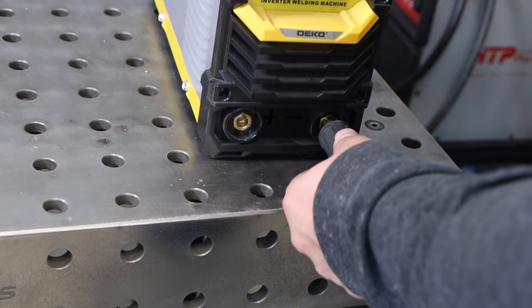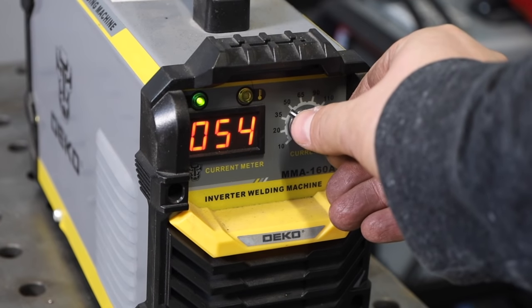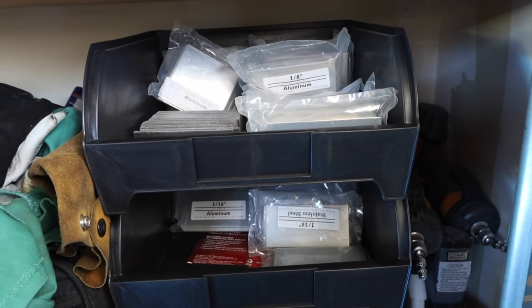Another little trick to make this easier is to switch the cables so I'm connecting my electrode to the negative side instead of the positive — that will cause it to penetrate a little bit less. I made a whole video about how that works. Then I'm going to dial in the settings on my machine, starting out with 55 amps, but I know this machine is notoriously off on its amperage readout, especially welding on 120 volts which is what I'm using today. I'd recommend that everyone practices or tests their settings before pretty much any weld on their project — it saves you a ton of time and you can correct errors early on.